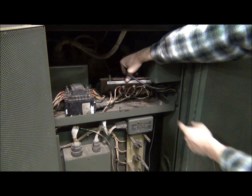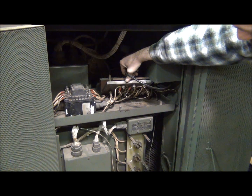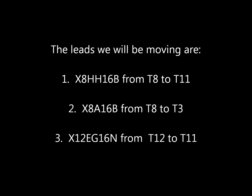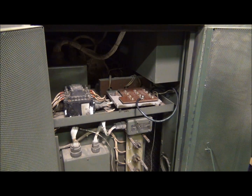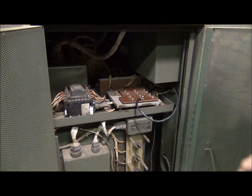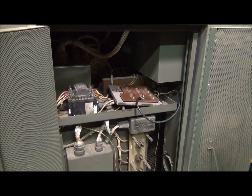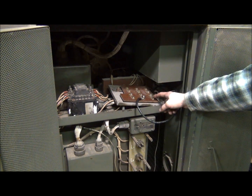You can see under here that it's not only the generator's 12 leads that go to the terminals on the board — we've also got several other things tied in there, and we're going to need to change a few of them. The first two wires we're going to be moving are on T8, which is this connection point right here. We'll lift the voltage reconnection board up and take the nut off of that terminal. We've removed X8HH16B and X8A16B from T8, and they're both just floating loose under the board now. We'll go ahead and reconnect X8A16B to T3, which is this connection point right here.